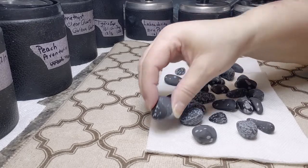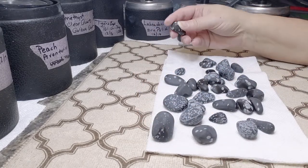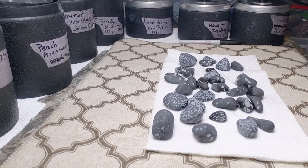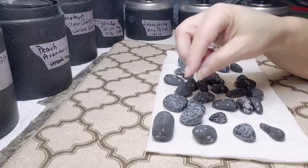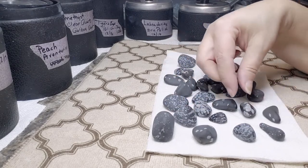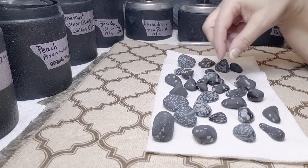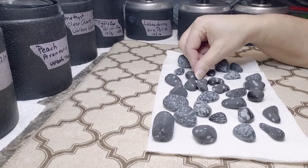So we're going to give it a wash cycle and send it on, I think directly to 1000 grit. I don't think it really needs to go through 500. We're going to skip that stage because, again, these stones have already been in polish and we didn't like it, and now we're going to repair it. So we're going to skip the 500 pre-polish stage.